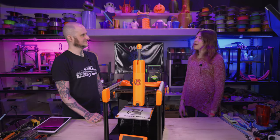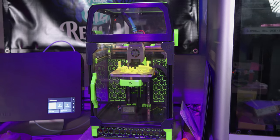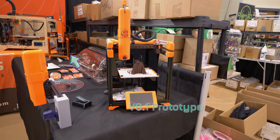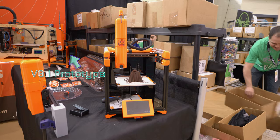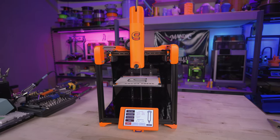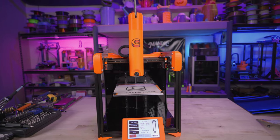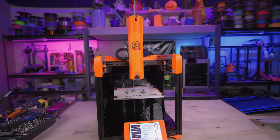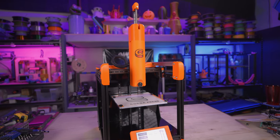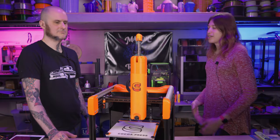Why the V0 design philosophy? One thing was simply that I have a tall, heavy extruder. In a small form factor, what can hold a — at the time — three-pound extruder, now closer to two pounds, without having a bar on top it's going to run into? So a lot of it was really the practical side. Chocolate printing is very finicky, and the easiest way to make it work well is to control all the variables. That's why having your own dedicated machine is nice. Obviously a smaller market than selling a small add-on for existing machines, but I can make the precise temperature control I want without having to figure out every version of every different manufacturer's printer.